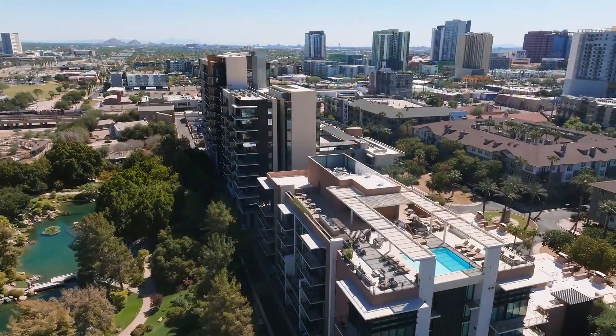Talk to a local contractor — if you needed a five-ton system and lived in Phoenix, I would not install this system. I would maybe consider installing a couple of smaller systems or a Daikin Fit Enhanced, or a combination of both.